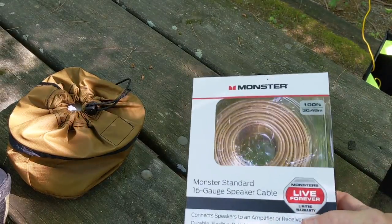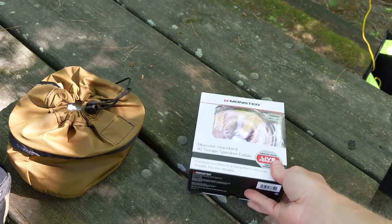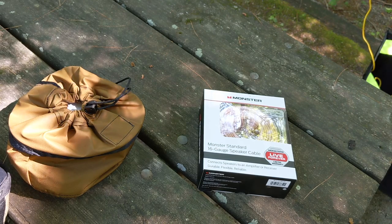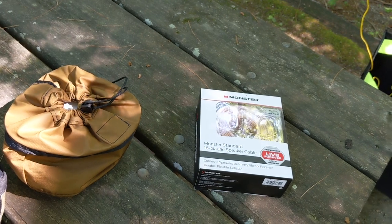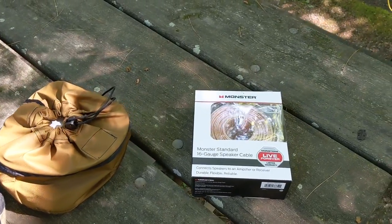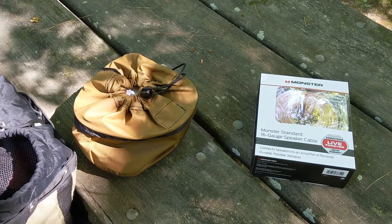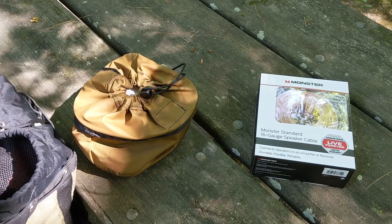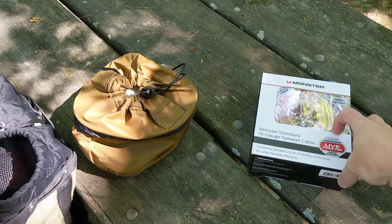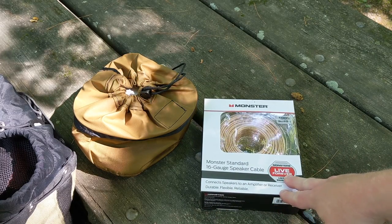What we're going to do is actually a very, very simple antenna. And it works with radios like, hopefully, the X5105. I've never tried this with the X5105, so I don't really know. But basically, this is a random wire antenna that, instead of having a separate 4-to-1 or 9-to-1 transformer or something, just uses the antenna tuner to find the match. This is a great, really cheap way to get on the air and make a really simple antenna with a radio like this.